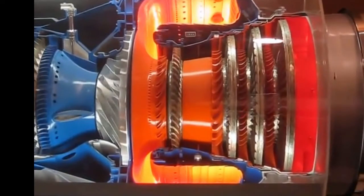Now we can see the power section of the engine. The first section was the gas generator section — the gas that's generated is the air through compression as it goes through here. Remember, the area that surrounds the centrifugal compressor is called the diffuser. It captures the compressed air and directs it into the combustion can where it's united with fuel.